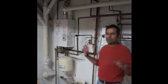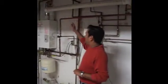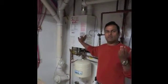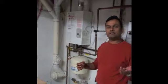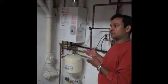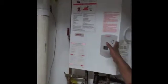The heated water in our storage tank comes out via this pipe and is fed as input into this tankless water heater. The great thing about tankless water heaters is that they're modulating — they burn less gas when you need to heat the water less, and more gas when the incoming temperature of the water is lower. In this case, we wind up burning barely any gas. In most cases, we don't burn gas at all to pass heated water into the house. If there were not enough solar energy to be gained in our tank, the tankless water heater would burn natural gas to make up the difference.